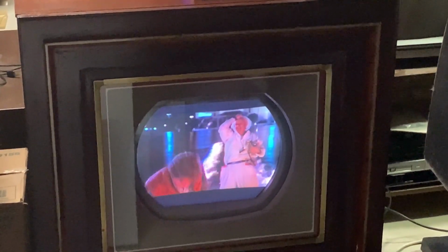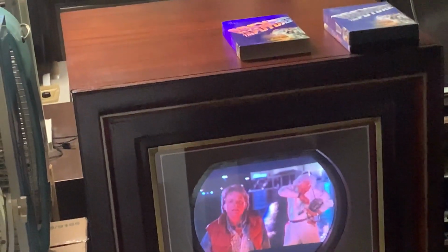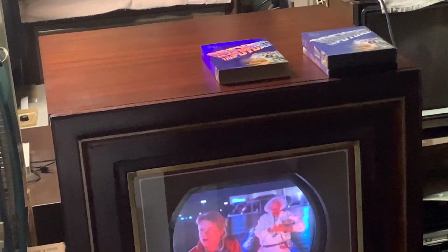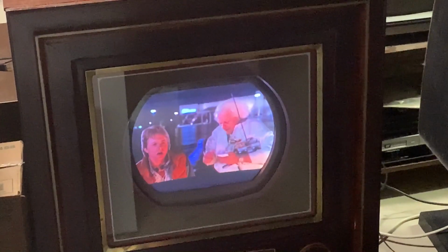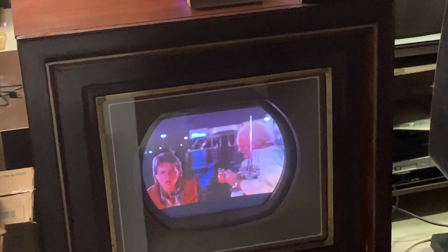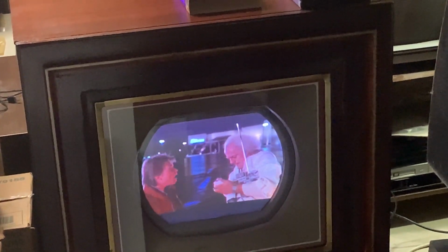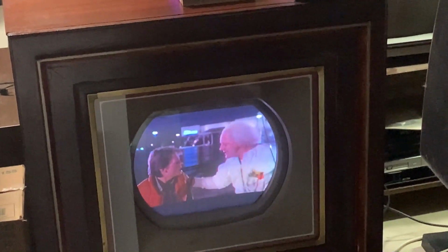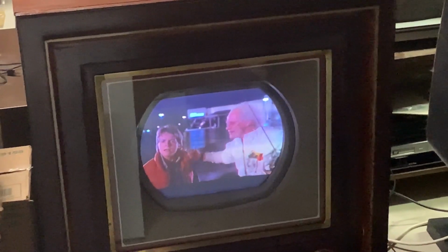In 0 seconds! The best thing about this is the audio is going to be immune to macrovision because it's directly past all the IF stages. And the video, it still does it, but I can adjust the vertical hold to the point where it hides those lines you see. And it seems to be working perfectly.